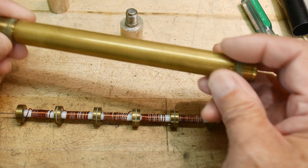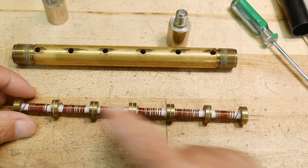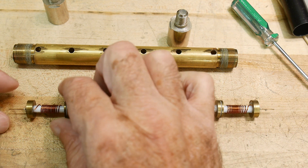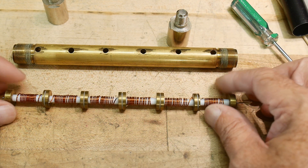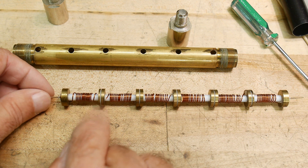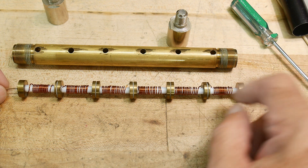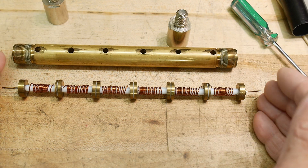It's got to be cheap to make — just a pipe, some connectors — though this internal piece might be a bit expensive to build; it's probably all special parts. The wires are soldered in: they coil around and solder into these discs. I don't think we can take it apart any further. It's kind of interesting that sometimes you have a thin disc, thick disc — and here thick, thick, thick, thin — so that kind of matches filter theory as well. You have smaller capacitors on the outside than the larger capacitors on the inside, matching designs I've seen.